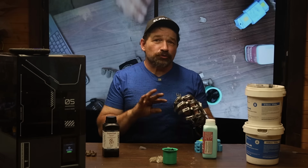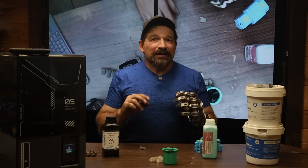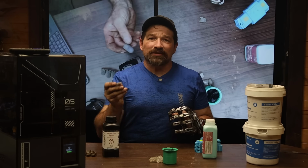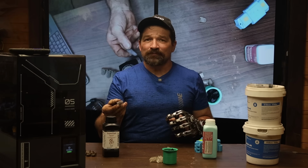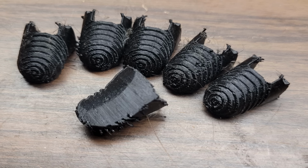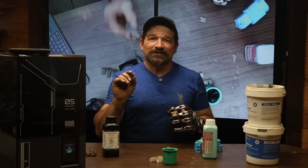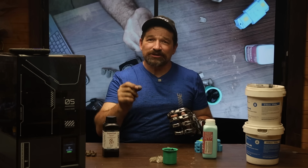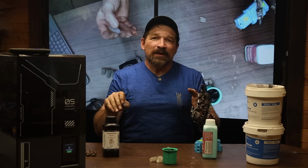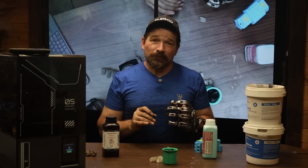This material tends to crumble and tear. Now, some of that is probably because of the surface topology that I'm shooting for on the tactile side of the fingertip. For the last while, the fingertips I've been making have concentric circles 60 thousandths wide and 45 thousandths deep. In practice, the profile allows the fingertip just a little bit of squish, and when it deforms, the coefficient of friction increases, and with that, also the holding force.